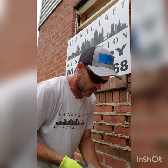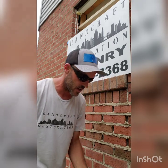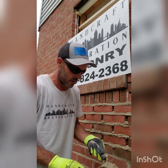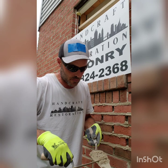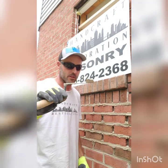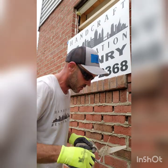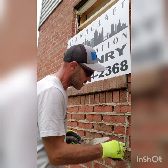So this is just what I have near me at the moment — my duckbill. It's the same concept. I'm going to go ahead and do the head joints. You want to get your mud on there but not that much — that just makes it unmanageable. When I get mine on there I usually swipe the edge, the face — you kind of want to tap it. Same thing with the little ramp idea. Go ahead and push your mud off there, and as you do, tilt the trough up as you're tilting your tuck pointer up and balance it. It will stay on there if it's sticky enough, but that's going to take a lot of practice.